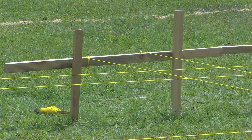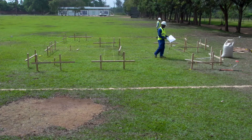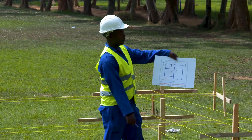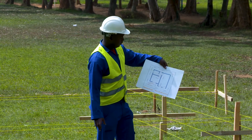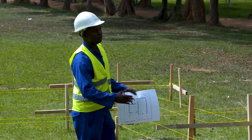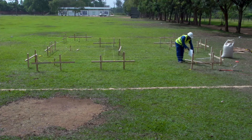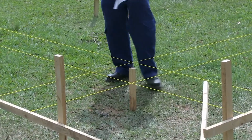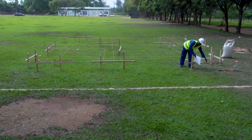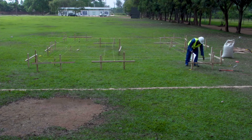Now we come up to fix the old building line. Now you can see some image on the ground, the same as what you have on the drawing. Those building lines indicate the width or the thickness of the foundation that we have. So the wall will be erected above this foundation. Here on our profile board, we have the thickness of the foundation.